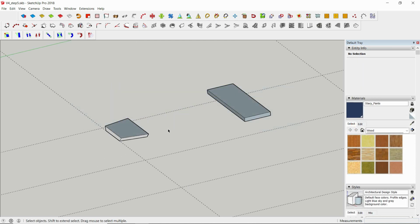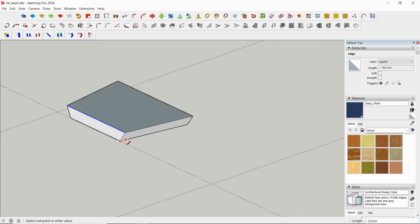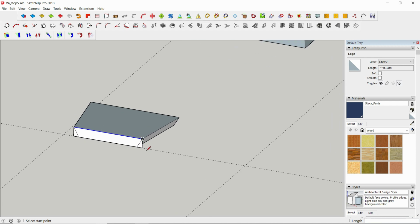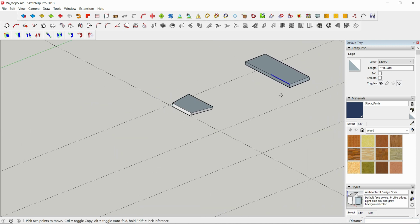So at first, when I want to do the longitudinal cut, this is the cut that you have to do on the table saw with a bevel box to get the necessary accuracy. I want to take these two lines, and right now they are not the same length. Yeah, so that's the length that I want. And on this side, I'm going to do the same thing. I'm going to make it a little longer, like so. Okay. Now it's the same length. Put them right in here, and then I know how much I have to cut off.